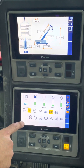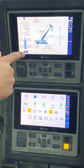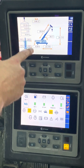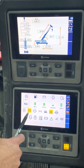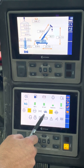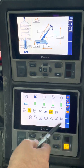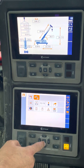I wouldn't rely solely on the tare — I'd either calculate the weight or use the tag — but it's a good way of double-checking that the weights match. On this screen I'll give you a couple more tips. You'll notice there's this symbol — if you're using the knob behind the right joystick you'll be navigating this screen, but with these buttons you can go back and forth without messing with that. This symbol highlighted yellow means something is active — for example it would indicate your tires aren't centered if that were highlighted. There's a whole chart that shows all the other indicators.